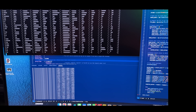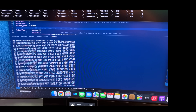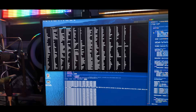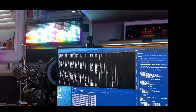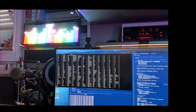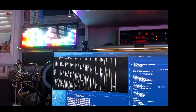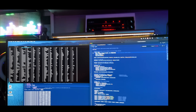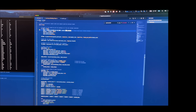Here we can see the ESP32 itself receiving the data over Wi-Fi. Here it's getting the first four band peaks and printing those out, and we can see those are then sent on to the actual LED matrix display, which shows us up here the display of the current audio graph. Everything on the PC side is done via simple Python script, and then sent via Wi-Fi in a socket by custom marshalling the data and sending it on to the ESP32. We'll take a look at the code later on, see how it actually works.